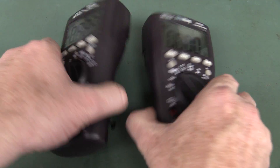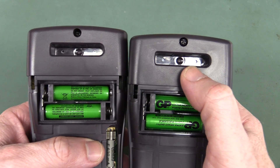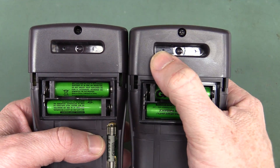Interestingly, if you've seen the teardown, I wanted to see if it was possible - it looked like it might actually have a pad in there for an infrared diode that we could hack in to convert this to RS232 capability. Because these two do actually use exactly the same case, and you'll note it does have those two holes in there for the RS232.